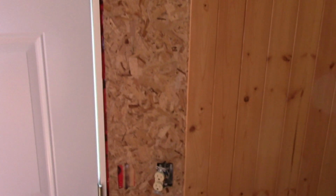On this side of the door, because I'm coming from left to right, I'm able to put the groove on the tongue and nail through the tongue. That's working great because I can hide my nails in the tongue. But when I get to this part, the tongue is going to be going in first, and I can't nail through the groove or else the other tongue won't go in. So I might have to end up face nailing a couple of these, but I hope not.